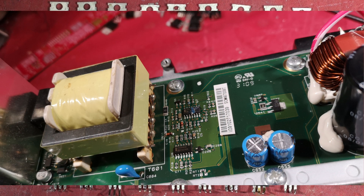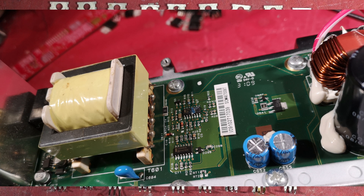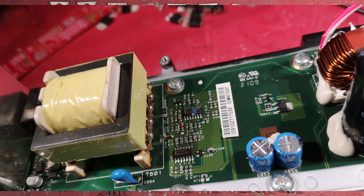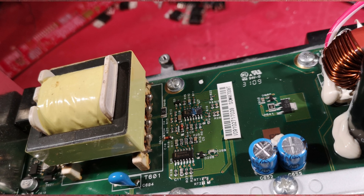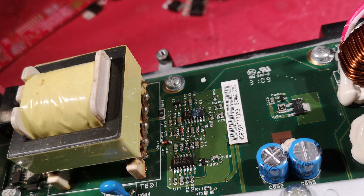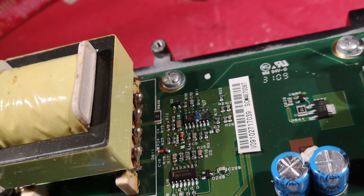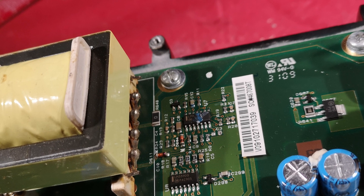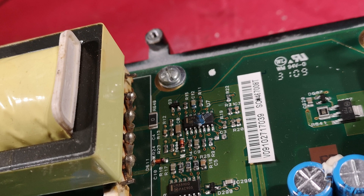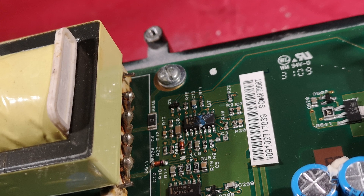I had a quick look at the circuitry and worked out what's going on. I think the only real way to make it work properly is to have a small management micro in there to monitor the rails and ensure there are no indeterminate situations. If the 20-volt plus rail dips down, the drive to the P-channel FETs can disappear — almost by half — so they're not fully driven off. And if the N-channel FETs come on, it fries the components.